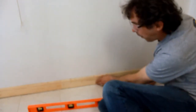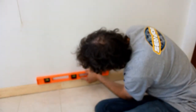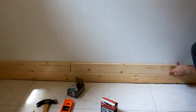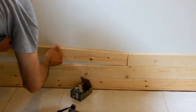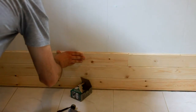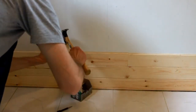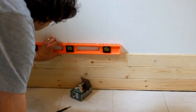Make sure you use a nail punch to countersink your finishing nails, otherwise it's going to look like crap. Row upon row, course upon course, making sure everything fits nice and tight. And whatever you do, always keep checking for level. Imagine what the ancient pyramids would look like if they didn't bother checking for level.